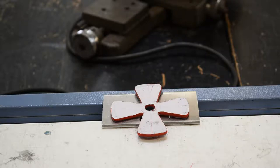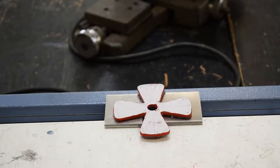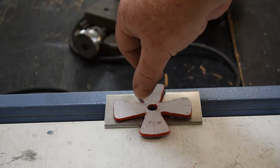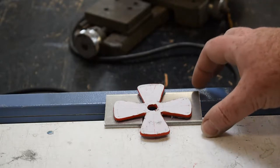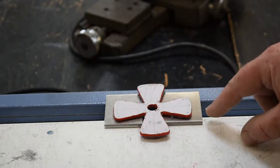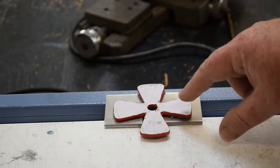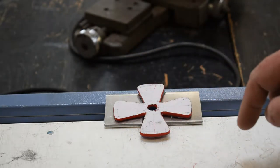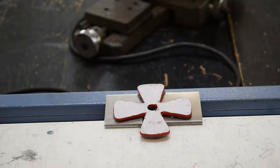So here we have the piece of plastic on the strip heater heating up. I've lined up the corners on the inside here with the wire underneath, and these two pieces of aluminium are just sitting above the wire but underneath the plastic, just to protect these two sides from excess heating. They will get hot, so do be careful when dealing with them if you're doing something like this. Come back in a few minutes once it's smooth and show it being bent on the block of wood.